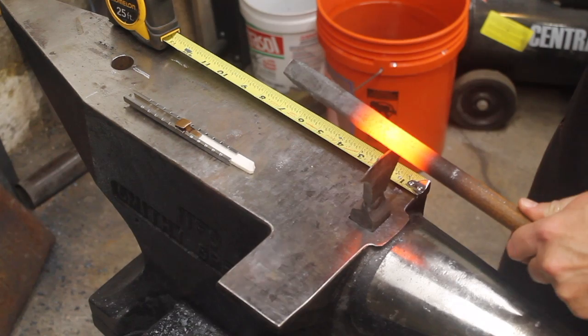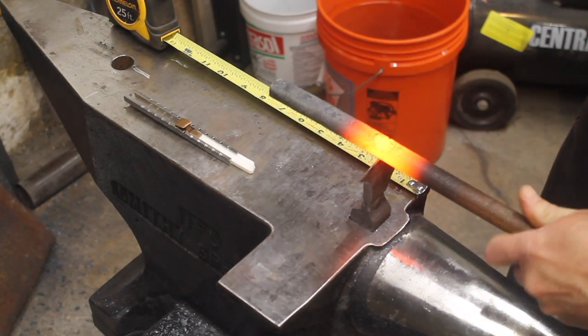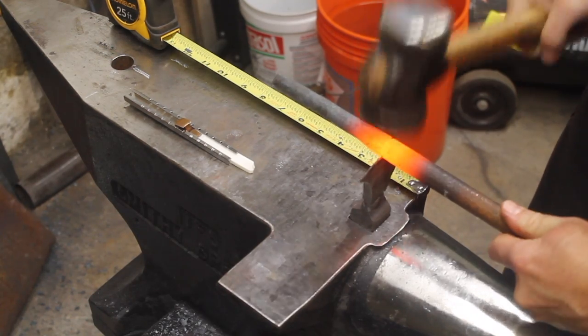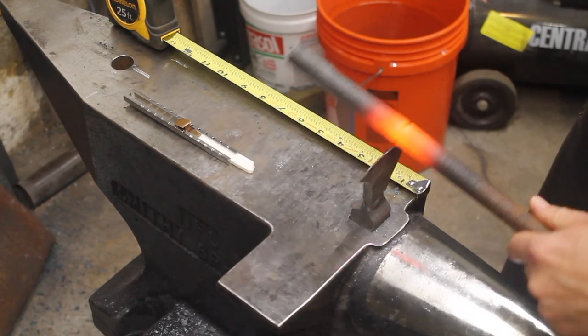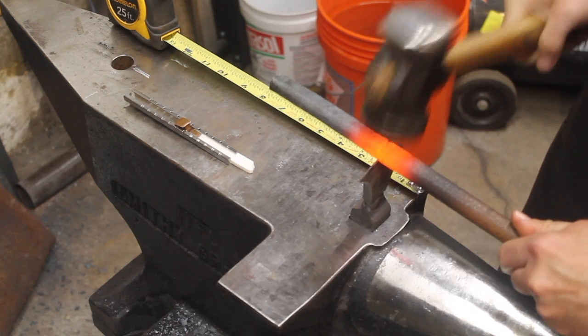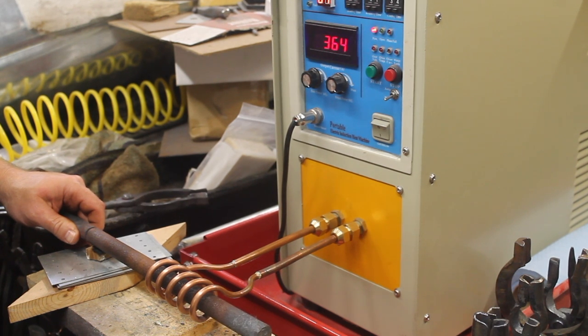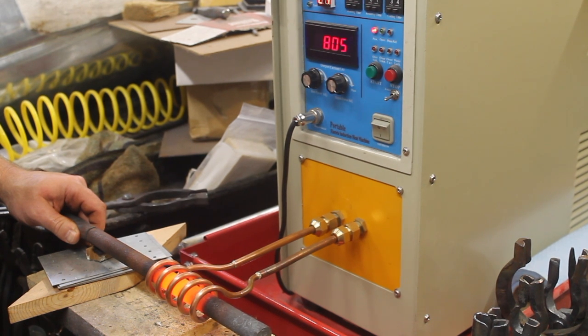Going into this project, I had a piece of stock a bit longer than 11 and a half inches. So I'm cutting it part way through, both to mark the 11 and a half inch point and to cut down on heat transfer. This heat is a little longer than I need — ideally I would use my half inch spacing coil, but getting a coil on the machine for just one heat isn't worth it. Watch the output meter: it will sit under 400 until red starts showing, then it will ramp up to 800 as the red spreads. All three of these five loop coils are a bit out of range with cold three quarter round stock. Subsequent heats at or near the same region have enough retained heat to avoid this effect. The net result is that my first heat is going to take nearly a minute.